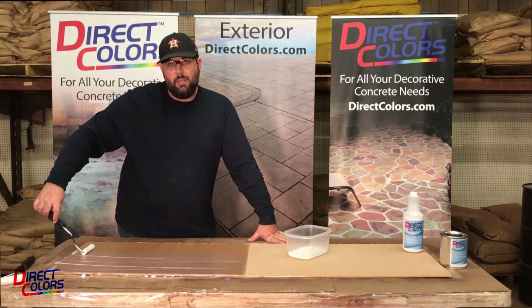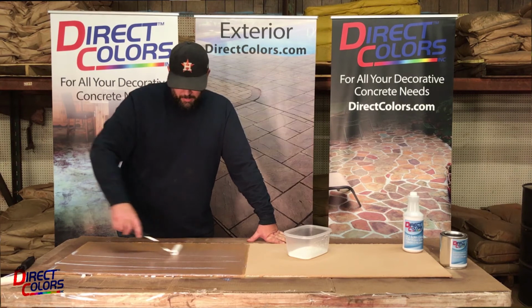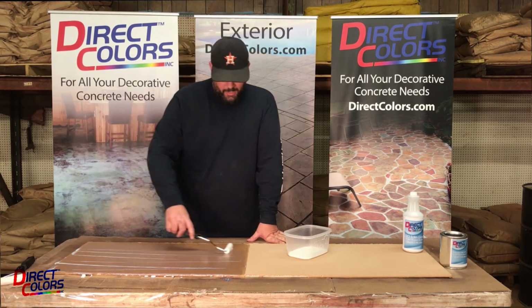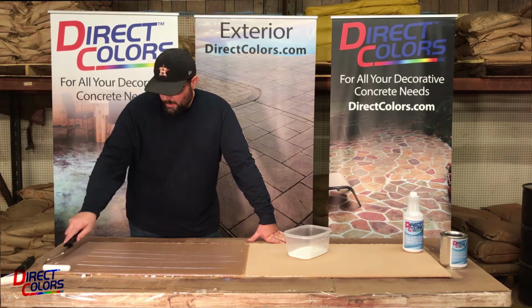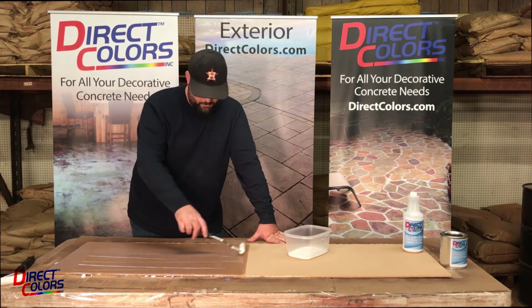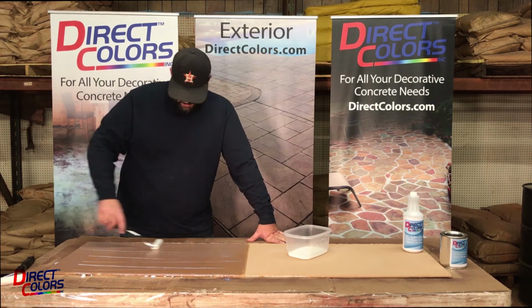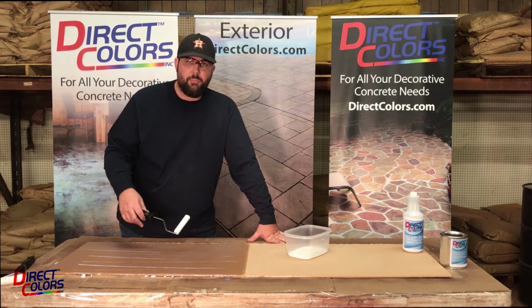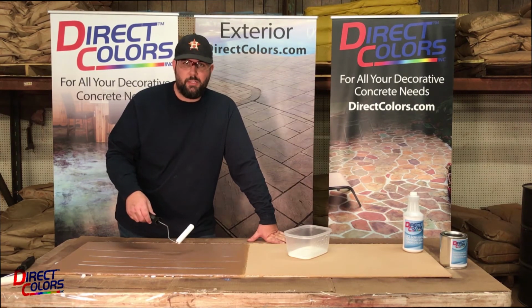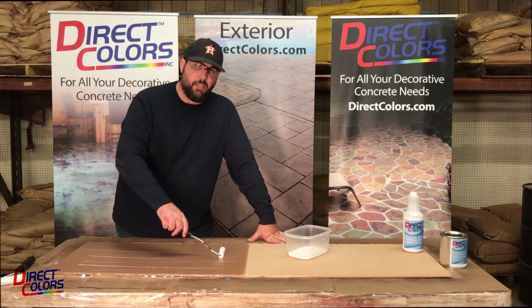Acrylic sealers are the easiest sealer to work with. There are other sealers, coatings, polyurethanes, epoxies, things like that. They're not quite so easy to put down. Acrylics are. Probably 90% of residential and light commercial are used with acrylic sealers, followed up with a wax coat finish. Direct Colors does carry all those materials to get you completely from the beginning to the end of your project.